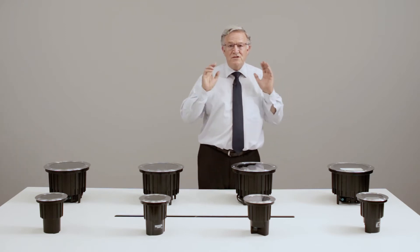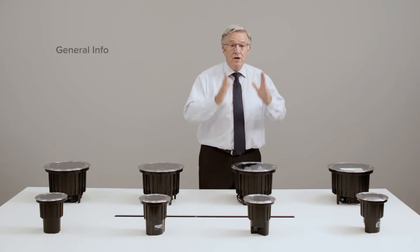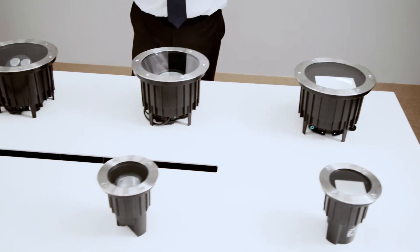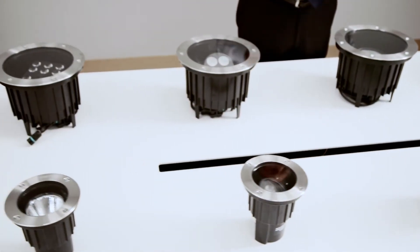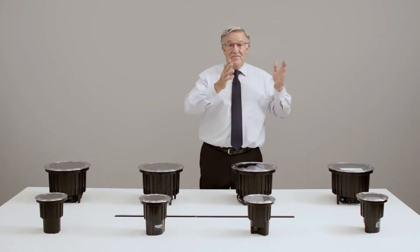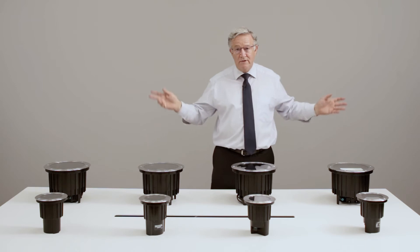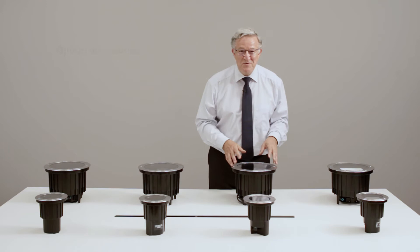The Keplero family is quite large. It comes in two sizes — 28 cm and 16 cm — with 21 different light beams and functions. These must of course be multiplied across 3,000 K and 4,000 K color temperatures, electronic drivers, dimmable, DALI, and DMX for RGB white — yes, there are some RGB white options as well.